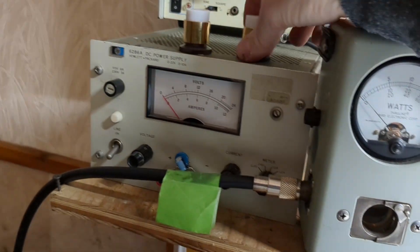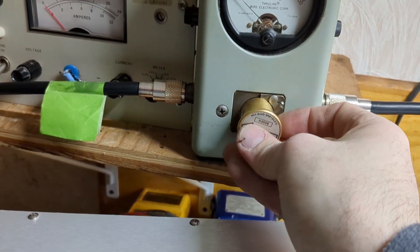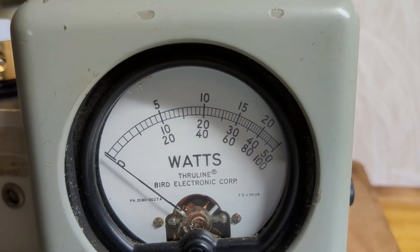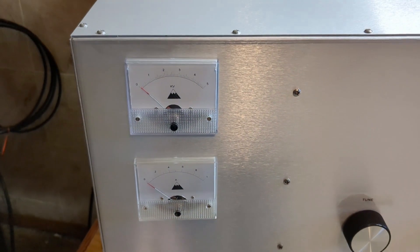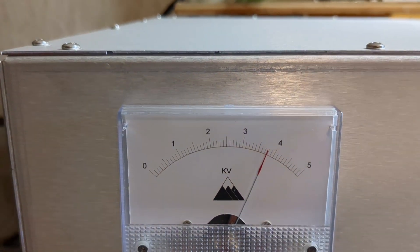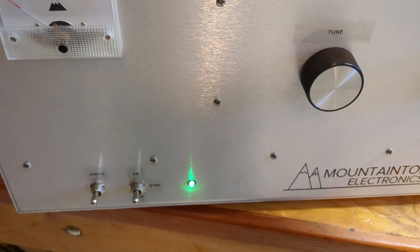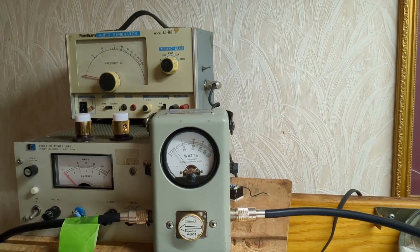Okay, we're on the 5000-watt slug, still on peak. Middle scale: the 10 is 100, the 20 is 200. Let's put the box on — you'll see the step start. We're idling at 3500-3700 volts. Let's put the box into AM — you can see the LED switches on transmit. The box is already tuned and loaded.